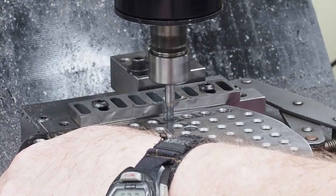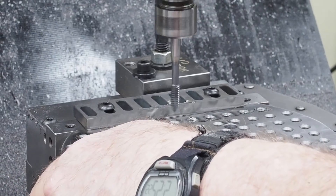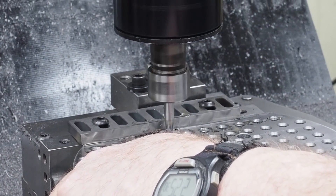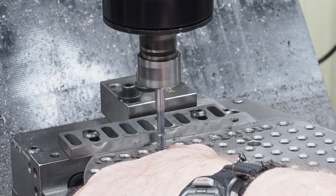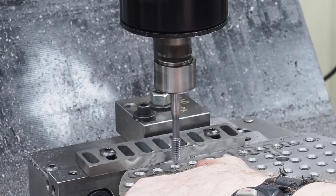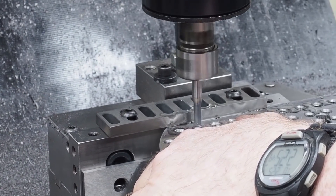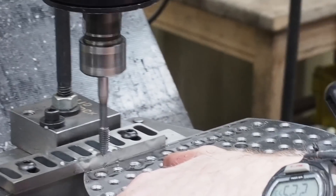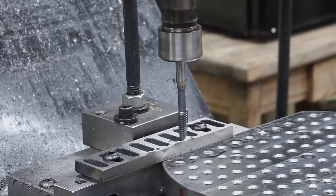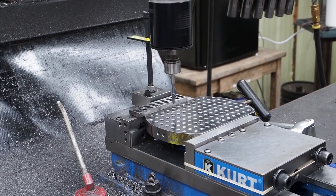I love this automatic tap head — it makes short work out of projects like this. So far that A-Tap is working really nice, very free cutting. We have the clutch package set on here for the OSG High Pro 7, and I can tell this tap is cutting a lot nicer. Even though they're more expensive, they last a lot longer and they're tougher, and they can tap some of your harder material — your D2s and M2s. We primarily got it because we were having trouble tapping DC53; the taps were wearing out quite fast, and this so far seems to be doing the job.